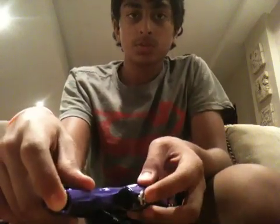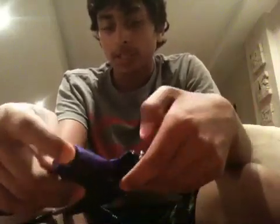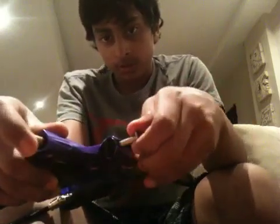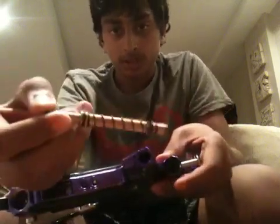This makes the bolt smooth — that's right. So you have to take out your bolt first before taking the ram out. Don't pry it open. Take the bolt out first, and then the ram comes out like that.